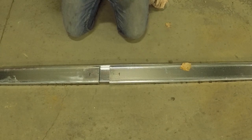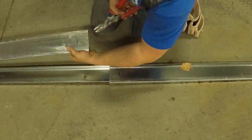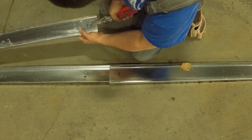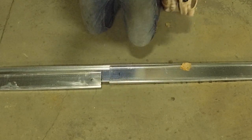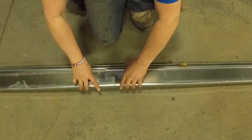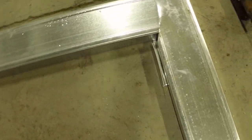This is a fishtail. You go two inches in, cut the center up, and then overlap it. So every piece that you measure tight, you add two inches for a fishtail if you need to join pieces together. You also want to make sure none of these joints land close to a doorway — you want to go a full piece back from the doorway. That's why there are those little four-inch pieces at the door. Your top track will run straight across, and you can see how we overlap the corners.